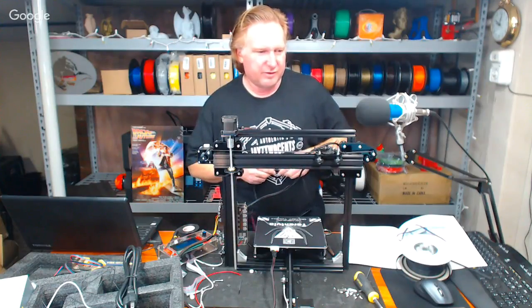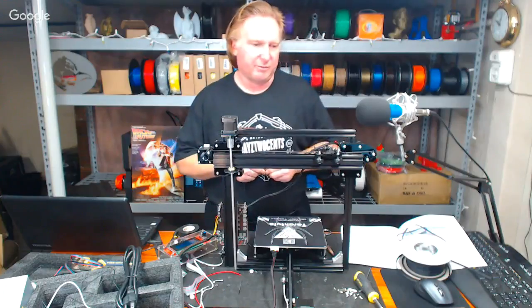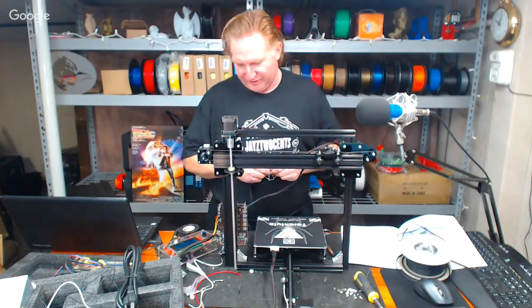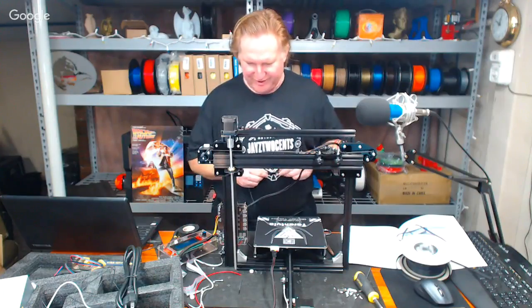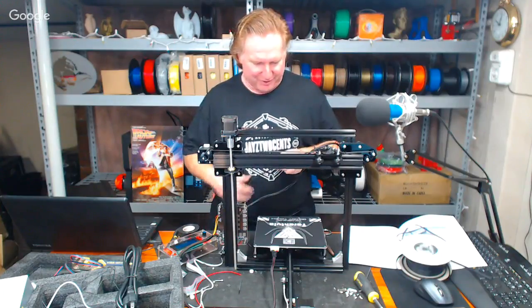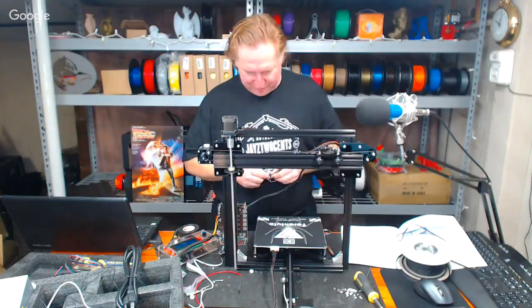Okay, so Maker Fun 3D, you want a MOSFET between the bed and the board. I agree. I'm going to be looking into getting one right away, because that size wiring with the solder connections on that board, that's not going to work. I really am curious how much power that board actually pulls, this heated bed. That thing must pull an awful lot of power.